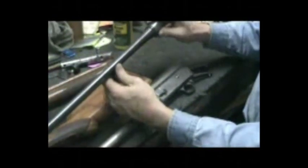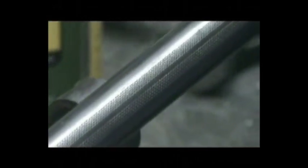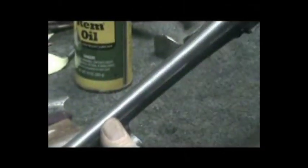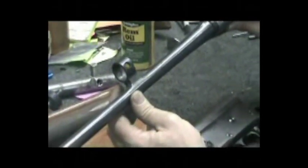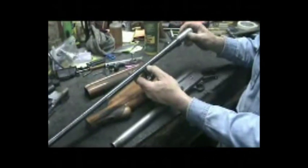We have to be careful on this one — it's got some lettering on the barrel. They all do, but this lettering is very light and it has the matting on the rib. They call this a matte rib; Browning's always called that a matte rib. It's a plain barrel with matting on it. So we've got to work around all this matting and save that light lettering, but we're going to salvage and save it and make this little gun look like new. We'll get it torn down in the next phase, inspect it for worn and broken parts, and then begin our polish work.